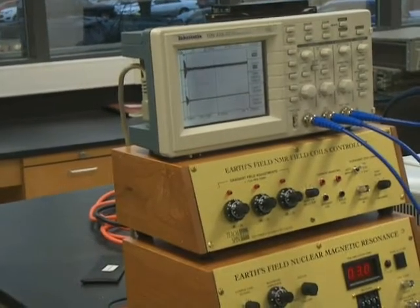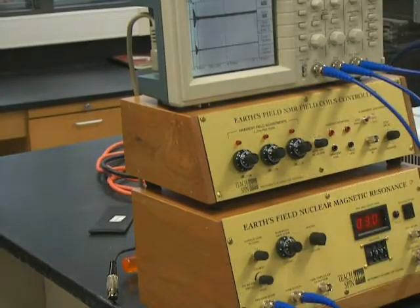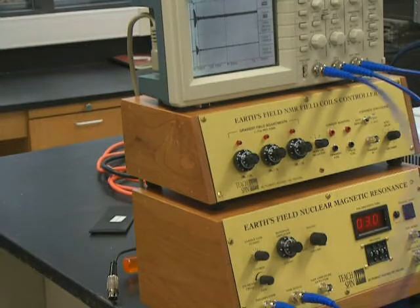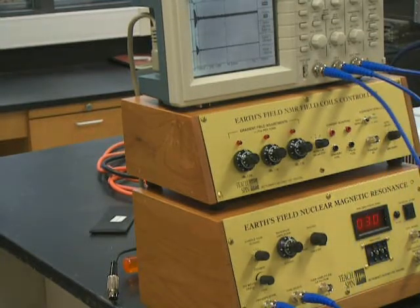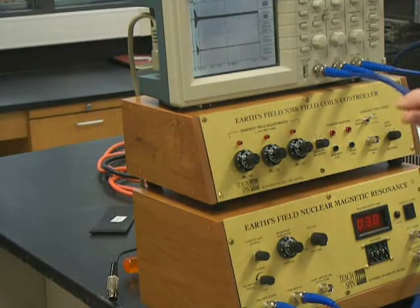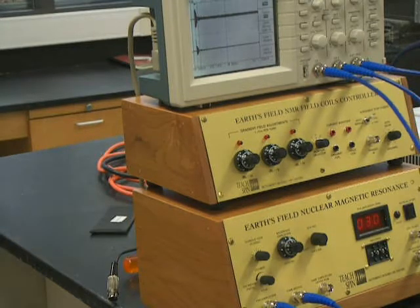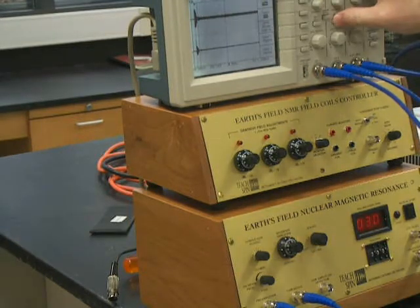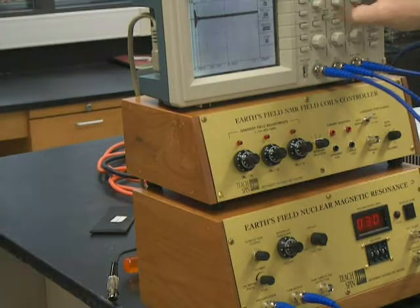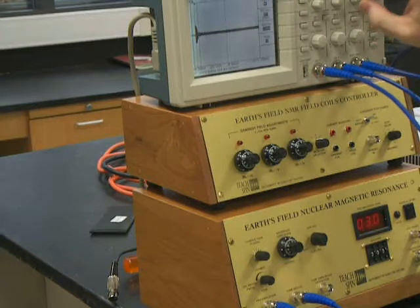Let's line the camera up and talk about how we adjust these dials. The first thing we do is tune our pre-amplifier. There's a little tuning circuit — there's a diagram in the book, you can look that up. We want to look at channel one before we get to the bandpass amplifier, so turn off channel two by clicking the channel two button twice, and position channel one in the center.